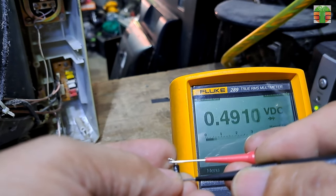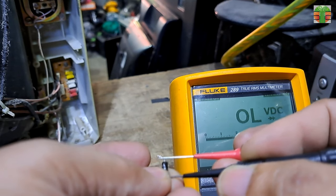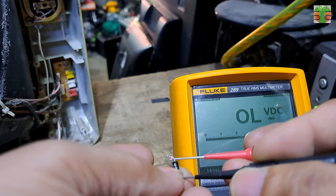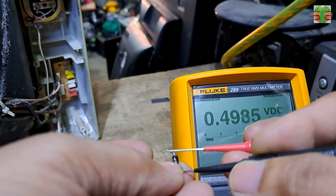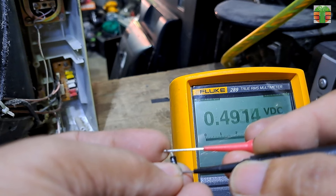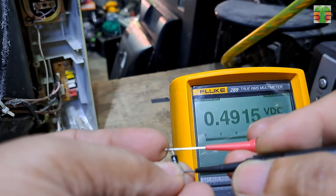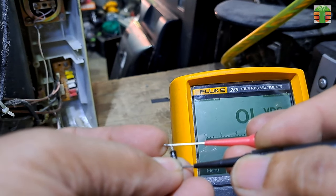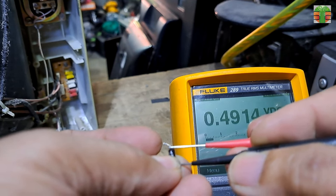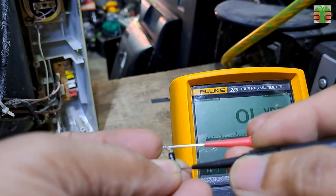Now it has a measurement. For some diodes, when you remove it, the test will get normal. The reason why when it is removed then suddenly the test is okay, is that it has an internal lost contact. If the leads bend, the silicon or the material of the diode comes in contact, so the test gets okay again. Look, when I bend the leads of the diode the test gets open.